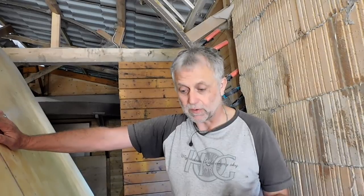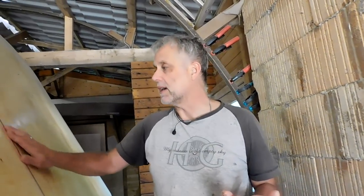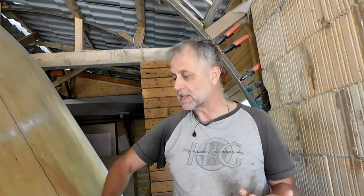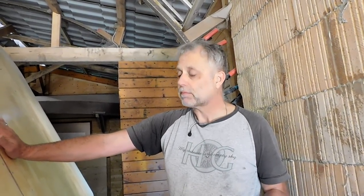You've got chop fibres, you've got microfibres, which are really short fibres, good for gluing and strong filling. You've got micro spheres and micro balloons, both of which are quite sandable, so much, much easier to sand. So if it's somewhere like that top skim there that I wanted to sand flat afterwards, I've used those micro spheres in that. Good, so that's done and sanded and smooth.